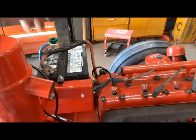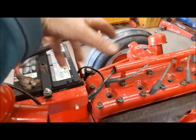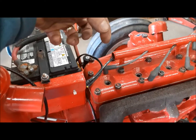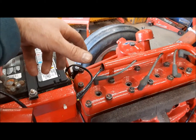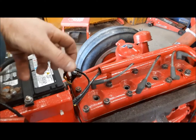So what we need to remember is on number 4 here, the rings are not broken or seated in yet. It's going to take doing some work and some cylinder pressure to get that accomplished. Like taking the thing out for a drive and lugging it around a little bit in 3rd gear. That'll make some cylinder pressure and get those rings seated in nicely.